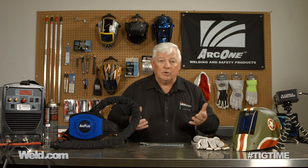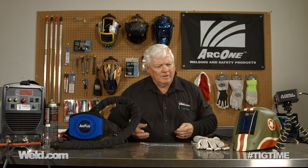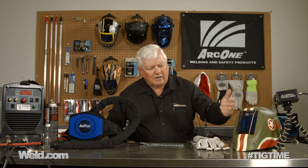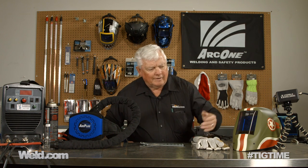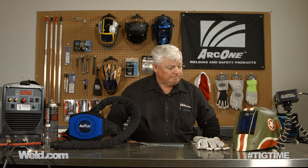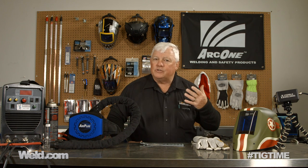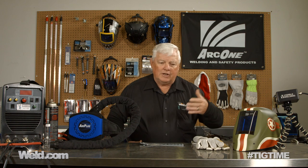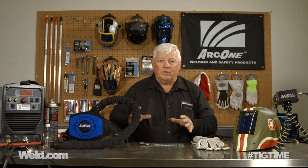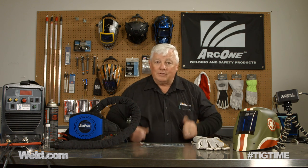At a shade five you can see real well — you can grind your tungsten, you can do other chores inside the shop. Kudos to this helmet. It's got a big wide face on it, a five inch by four inch quick-change digital lens in it. That worked out real well. I had never used one before and it was quite comfortable. The air flowing inside was like an air conditioner, if you will. I'm watching all this nasty stuff going on in front of me where I'm used to holding my breath. Overall, I've got to give it a thumbs up.